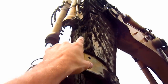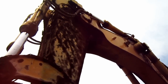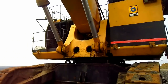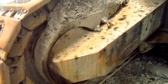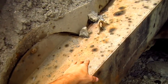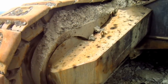If you look on the back of the stick, you can see the two bucket cylinders to curl the bucket in and out. And on the top of the boom are the two stick cylinders to push the stick in and out. Here you can see where the two drive motors are located to propel each individual track. Both the motors and the hydraulic lines that run to power the motors are encased inside these metal shields, to protect them from rocks or falling debris when the machine is in operation.